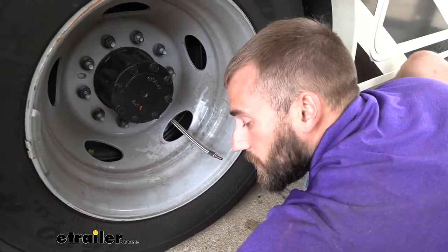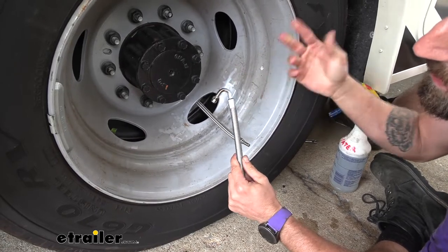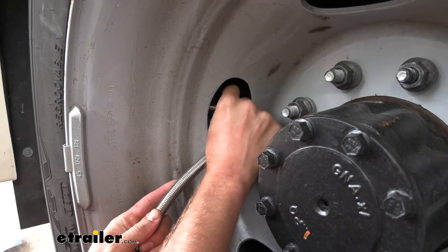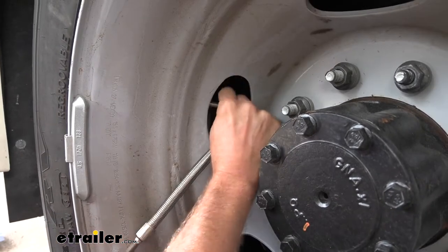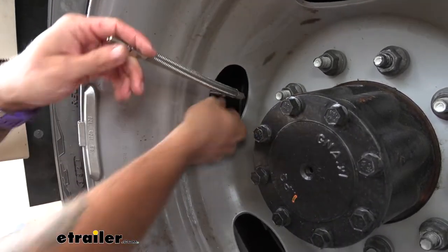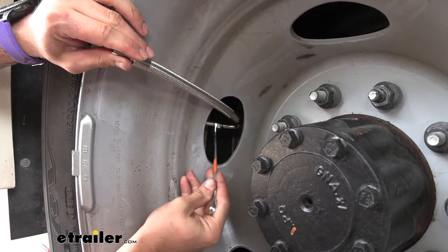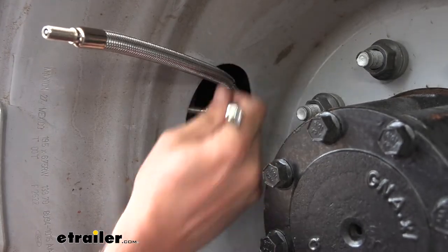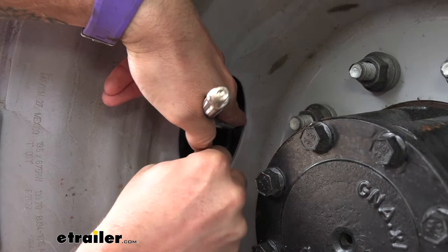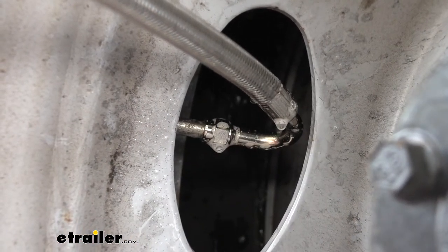Now we can go ahead and do our outer wheel. There are a few different styles — basically it's what kind of bend you want to have with it. Ours today is 135 degree, but there are other ones, especially like 90s, which are pretty common. This side's going to be a whole lot easier to do because you can easily see exactly where you need to be. We'll just tighten that down — that's starting to let some air out, which means we're pressing on that center. We got that nice and tight. We can take a 7/16 wrench and fully tighten that down, angling your hose exactly where you want it to come out and holding that in place as you fully tighten it. Then we'll take some soapy water, spray that on there, and we don't have any air bubbles forming, so we know we're good to go.